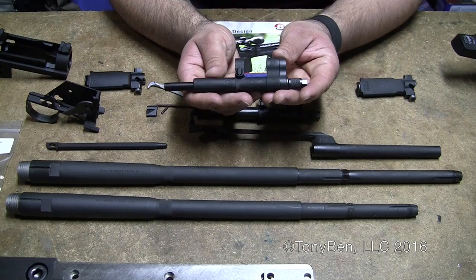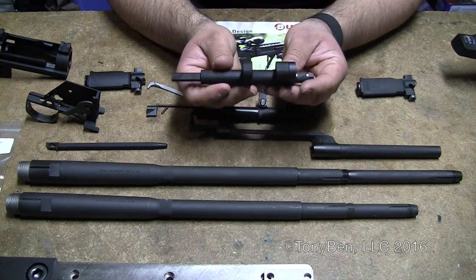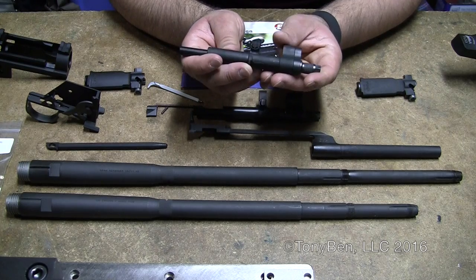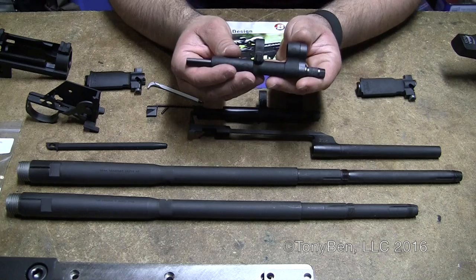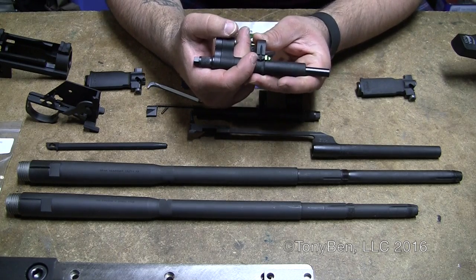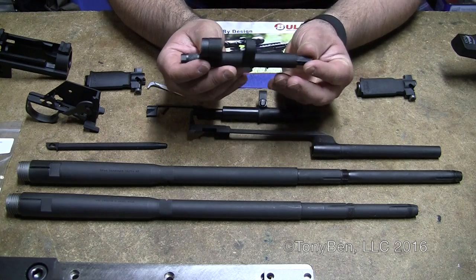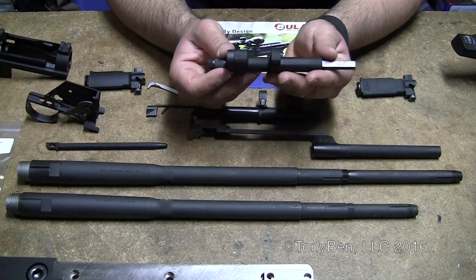Moving on, we now have their cast gas cylinder assembly. At first glance it looks just like any old gas cylinder assembly and you think you couldn't tell the difference. But actually the spindle valve is fake — this has no spindle valve whatsoever, but the spindle valve shape has been milled in just to make it look authentic. If you look on the other side, there is no spindle valve and no roll pin, so there's nothing to turn. This is always fixed in the open position and you can't turn the gas valve off. For most people there really is no reason to do that anyway.